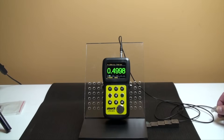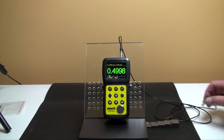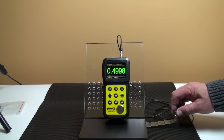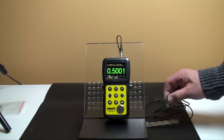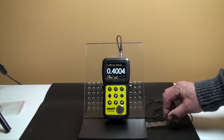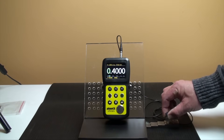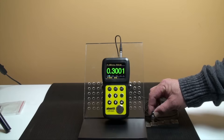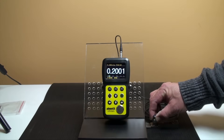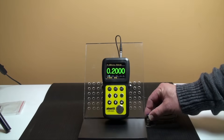Taking tests is very easy. After making sure your measuring parameters are set correctly — inch, metric, and velocity of material — place a small amount of gel on the workpiece and then follow with the probe on the workpiece. Readings will show on the screen. Be certain not to use too much gel; use just enough to remove the air from between the probe and the test material.